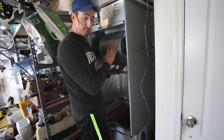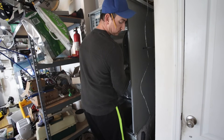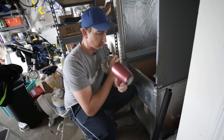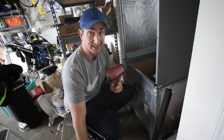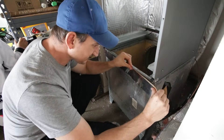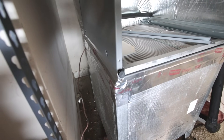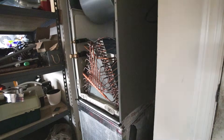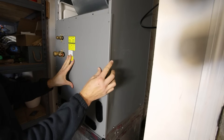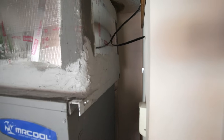This is still pretty heavy — I wouldn't recommend doing it by yourself. I called every neighbor I could and no one was around, so I just had to slide it into place. Now that it's in place, the next thing I'm going to do is seal it with metal tape. One little trick is that this metal is cold and the tape doesn't stick well, so it's a good idea to heat it up first. Here's a look at my duct transition — it's a little messy, but it should get the job done.